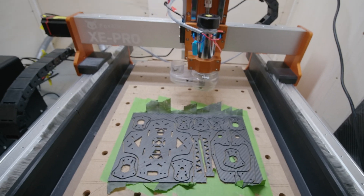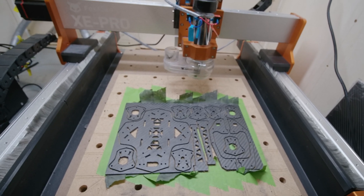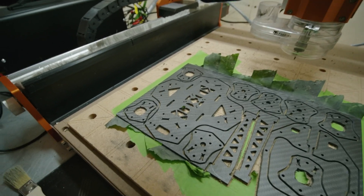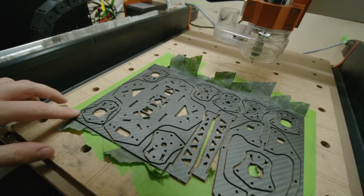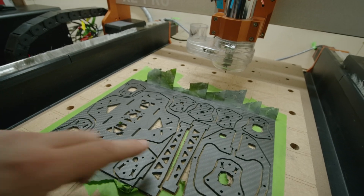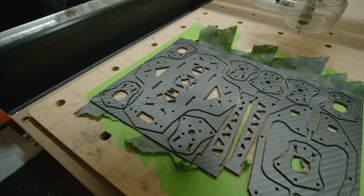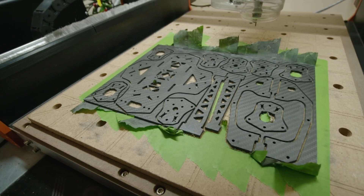So we just finished our cut. I did run into an issue where the tool was running straight across the frame - there's a line running all the way across here which has kind of ruined the part. It's not that deep, but for what I need it for I won't be wasting this sheet. I'll probably scrap that one there and maybe these two as well, but the rest of them are looking good. The cuts are looking good. It's getting late now so I'll probably continue this tomorrow - good progress.